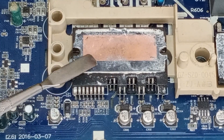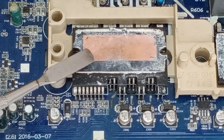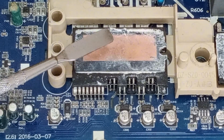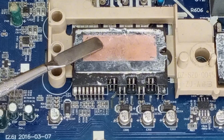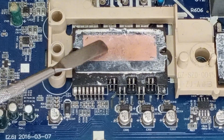Separate ICs are installed on these pins. When signals come from the microcontroller, they create low voltages here. The generation of these low voltages causes the IGBT's low side to turn on. In this way, the voltages in the form of positive and negative signals are generated and sent towards the compressor.